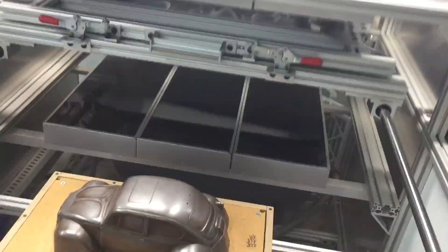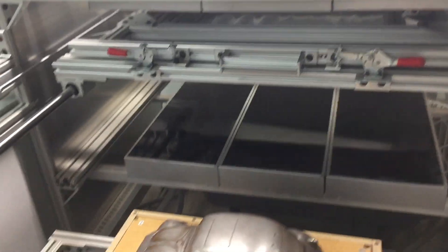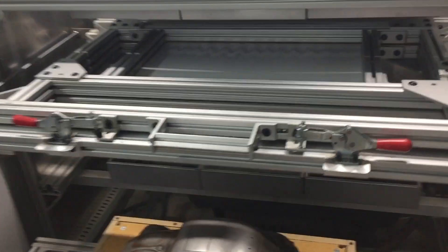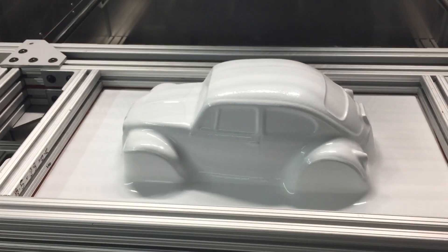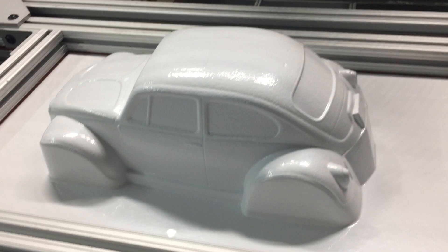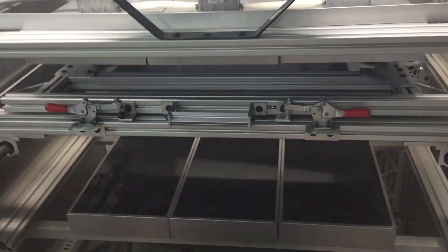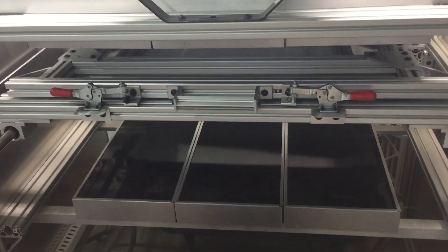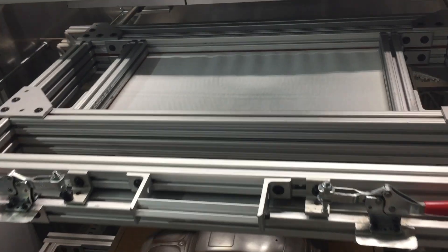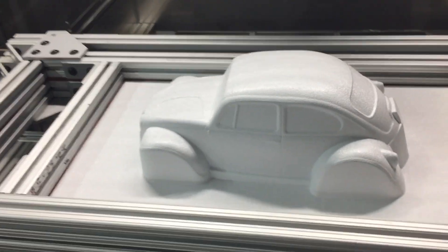I'll show you one live in action. I've done a few already and they haven't come out exactly the way I want. I've learned that it takes a lot longer cooling time on the mold before you can pop it off. This time we'll do it smooth side down and we're only cooking it for about 20 seconds. This is 0.060 — 0.040 polycarbonate takes about 10 to 15 seconds longer. You can see that formed pretty well. I've got the cooling time set a lot longer now.